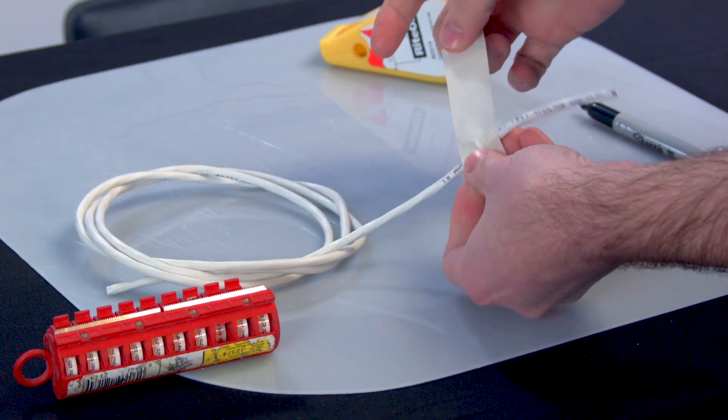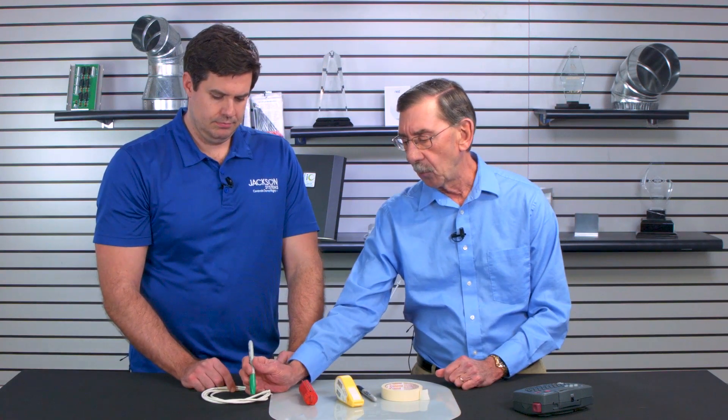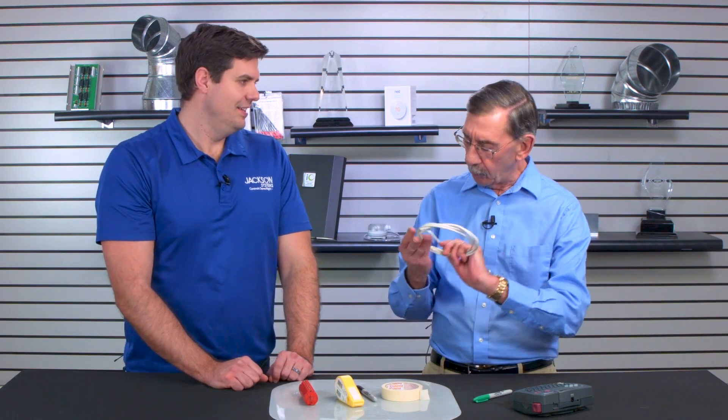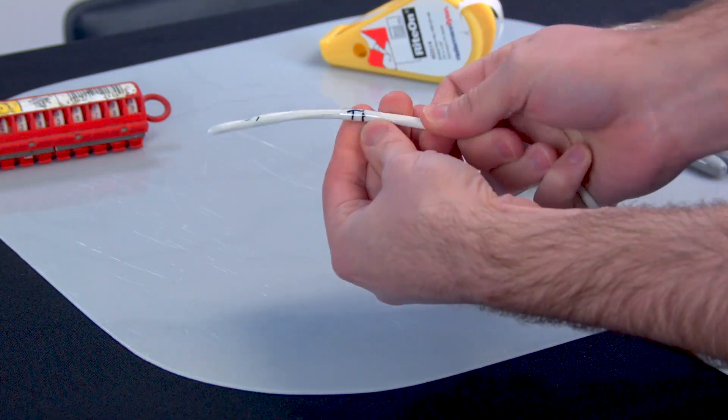Last but not least, the old standby — either duct tape or masking tape, as long as you can write on it and it doesn't smear real bad. Masking tape is pretty durable. I like to use it because it's cheap and it works. You could also just take a pen and write directly on the cable, but that's last on my recommendations, because if you do it too close, I've got to land this job and I start stripping cable and all of a sudden — what was that? I missed it. Hey, by the way, when you tag wires don't tag them right at the end, because I've got to strip all that insulation off and get them all dressed up. Make sure you're back far enough that it gives me room to do my job.